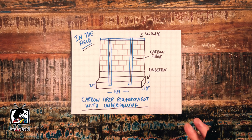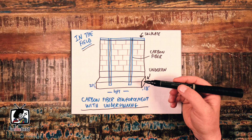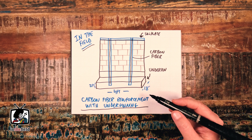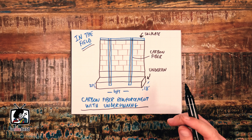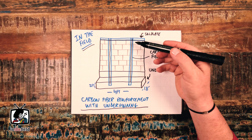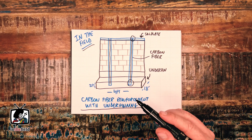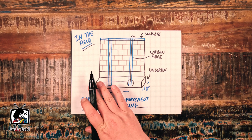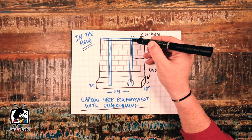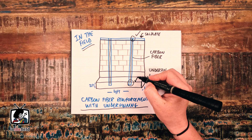The carbon fiber product we used on this repair was the SRS structural product — a fantastic product. We essentially started the project from the inside of the foundation walls by installing four separate underpinning sections by hand, approximately two feet below the existing footings and approximately 18 to 20 inches beneath those footings. Once these underpins were carved out, we formed them up with timber and installed vertical carbon fiber strapping onto the damaged foundation walls, from the top of the sill plate all the way down to inside the underpin itself.